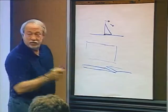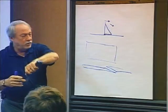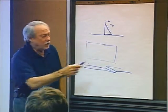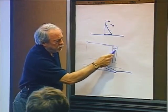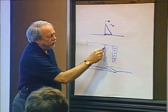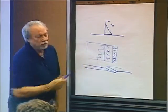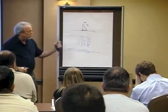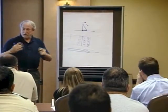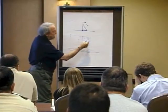When you skive these belts, what you see when you look down at them widthwise, this way, is you'll see a certain amount of the rubber on the back side of that belt will be exposed. This would be rubber, okay? Then you'll see another place, and this will be nylon. And then this again is rubber, okay? So when you skive the belts, when you skive a nylon core and you're putting it together to get it to carry a load, the two ends have to match.